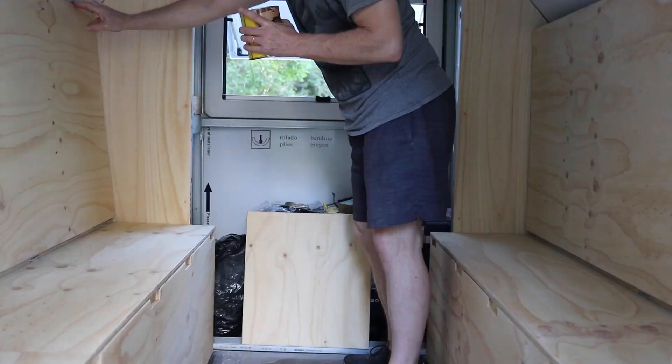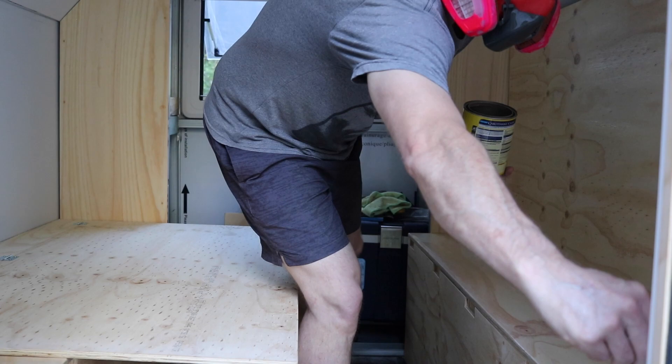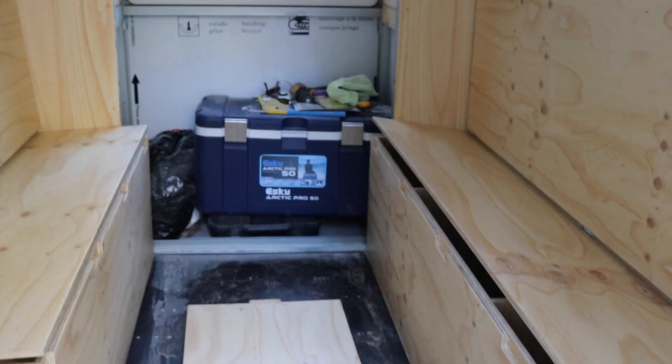Wax on, wax off. I've used a clear varnish that's got a matte finish, and it's also water-based, so it stops all that odour coming up off the timber when it's done. It's a really strong odour if you don't use a water-based one, especially in a small space like this.